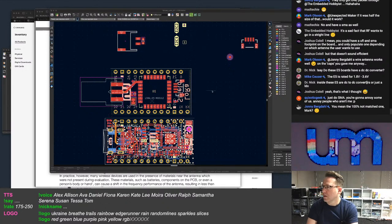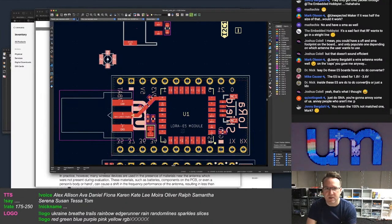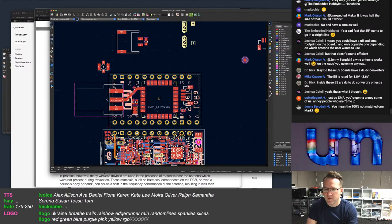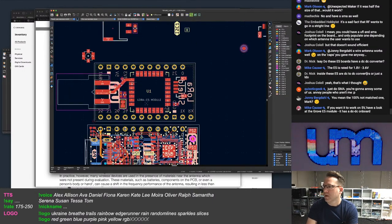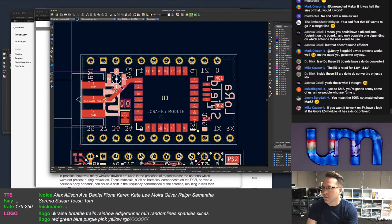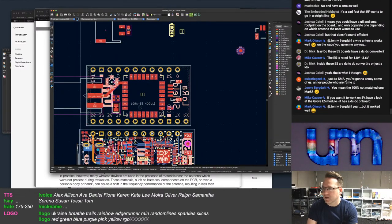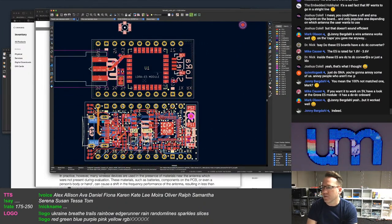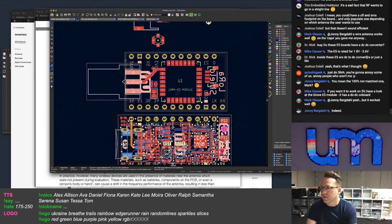That one. Okay. So there's my UFL. This is my standard. This is the one I used on my TinyPICO UFL version, V3 UFL. So not only would this have to get put on the board, right, but it'd have to be far enough away from the SMA connector, if there was both, and a switch of some type, to be able to get your fingers in there to actually plug it on or not, which means I'd have to extend the size of the board